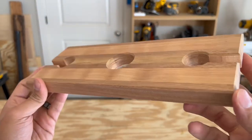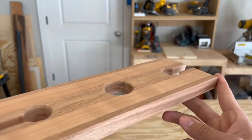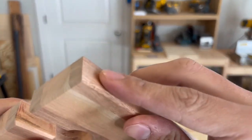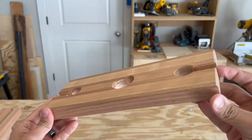There you go — transfer all the corners and all the edges. Now I just have to do some sanding. I'll sand it to 220 and then put some oil on it to get it finished up. Finish out these edges real quick, get around that edge, get rid of some of these burn marks, and I'll be good to go.